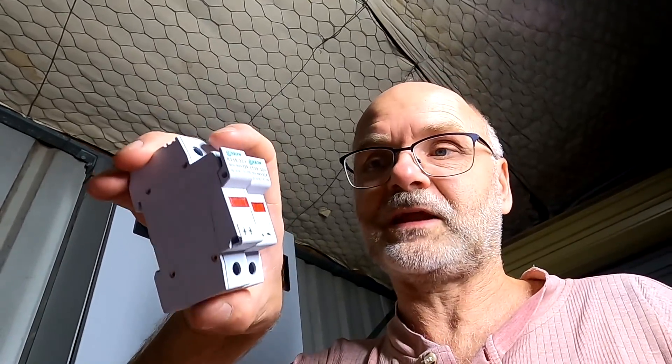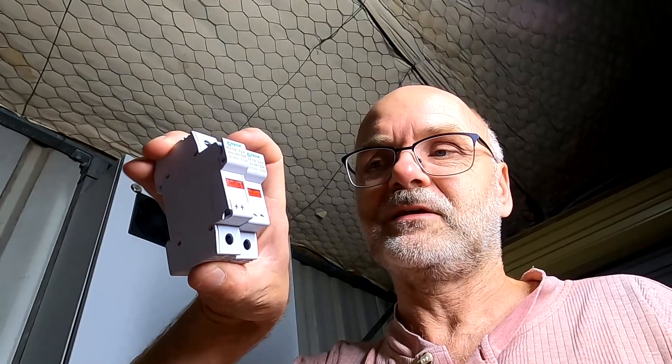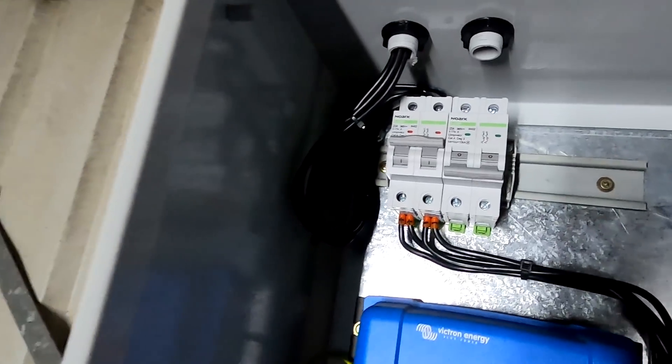The third advantage of a circuit breaker: when it trips it disconnects positive and negative simultaneously. A fuse only disconnects the string where that fuse melts, leaving the other still connected. I'm not sure if this matters in a lightning strike scenario, but it's worth noting. If you know other reasons to replace fuses with circuit breakers, leave a comment below.